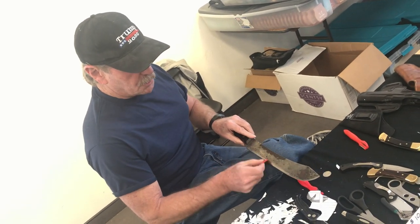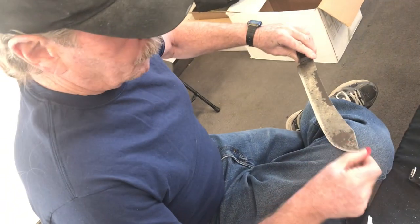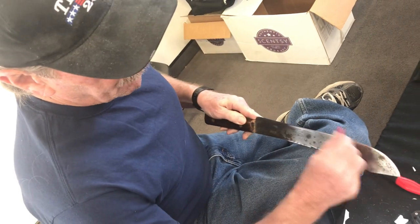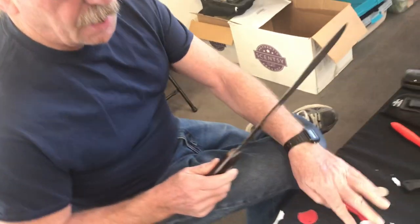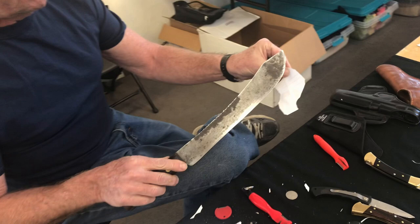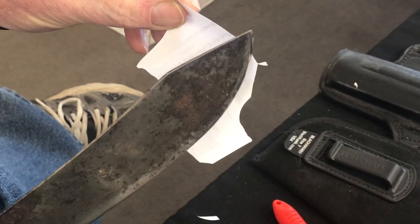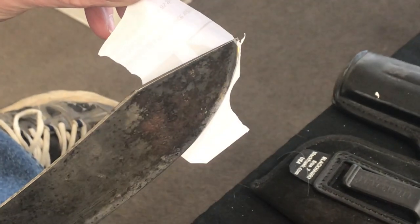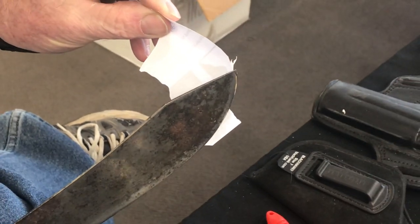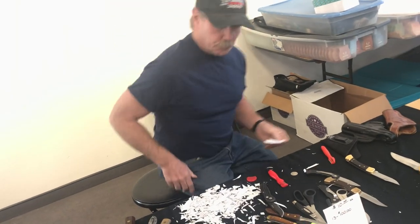If I'm going to sharpen that knife, normally I would sit down, use my leg for a bench, and just drag the knife towards me, just like this, go right on around. Turn it over and do the same thing on this side, but I tip it up as I get out towards the radius and the point. This knife just happens to be pretty darn sharp. If I can take this knife and make it cut like that, see how far out on that paper I'm making it catch? That's really a very sharp knife. It's thin, so that's kind of like cheating, you know? So let's see.